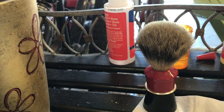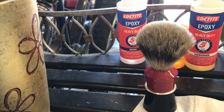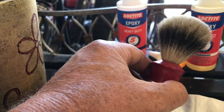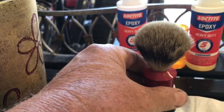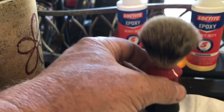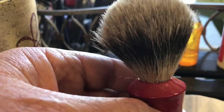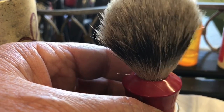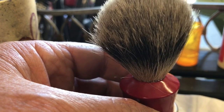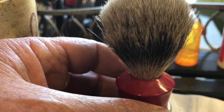I like to rotate it around so it gets the edges real well. When you put in the knot, you want to see a little bit coming out. As it's setting up, I turn it a little bit so the epoxy flows all around the inside of that knot — nice and secure. It says five minutes, but I generally wait about a half an hour. This will get very, very hot. You can just start to see some of that epoxy coming out at the bottom of the knot there, and that's exactly where you want it to be. Starting to get warm now — chemical reaction.